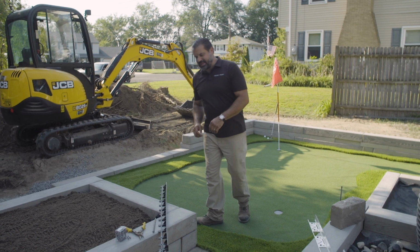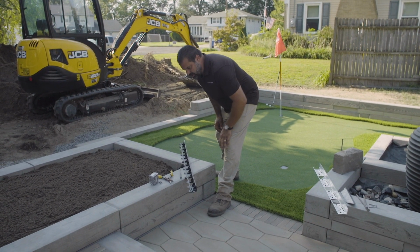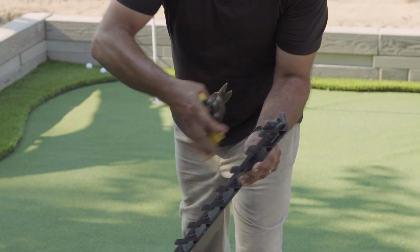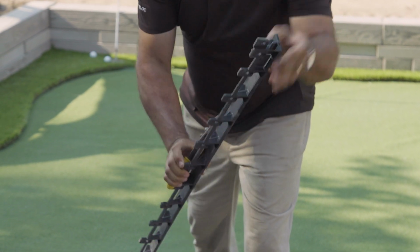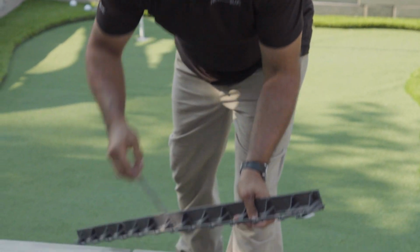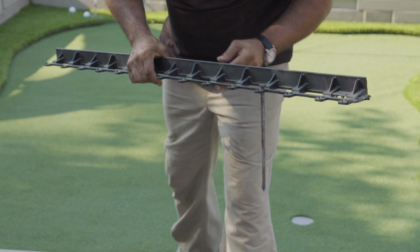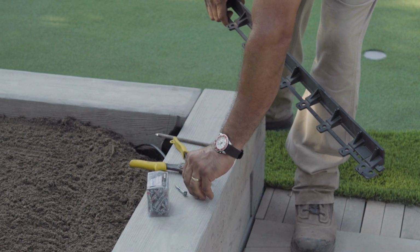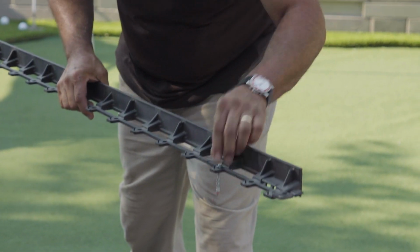Gator Edge by FlexLock. 2 different heights for 2 different applications. Also available rigid and flexible in one. For densely graded stone applications, you supply an 8-inch non-galvanized spike every 8 inches. In synthetic base applications such as Gator Base, all you need to do is anchor and zip tie it into place.